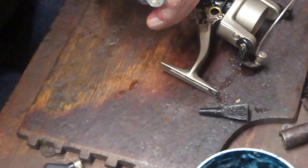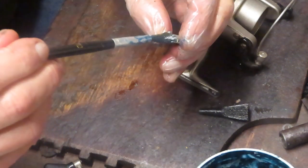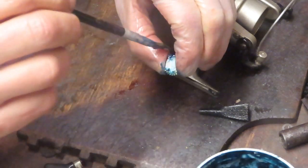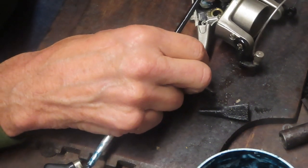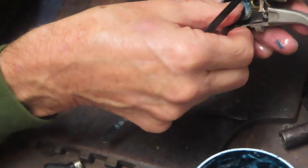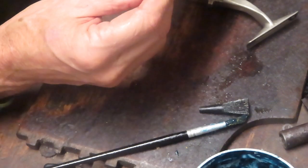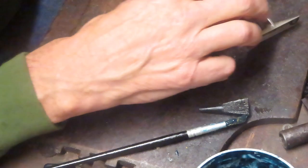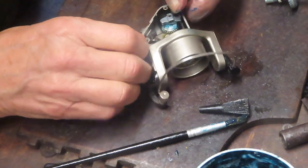This is the crosswind block, or oscillation gear — the gear that moves the axle shaft up and down. You want to get grease on every face of this. When you install it over the stud, make sure the stud on the gear is in the low position. It's easy to put this one in upside down, so if you have a question, go back and look at your pictures. That's the best answer in this situation.